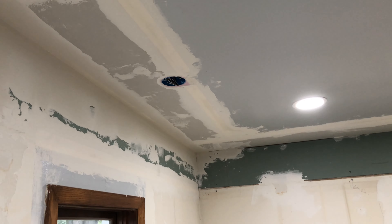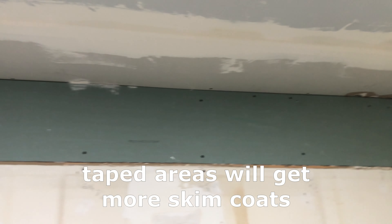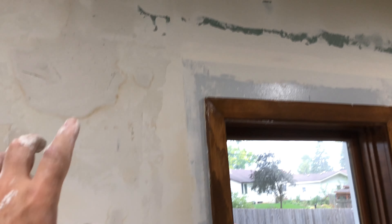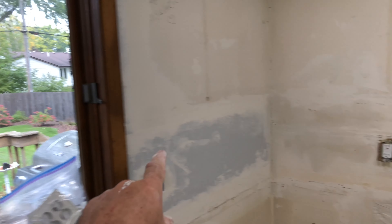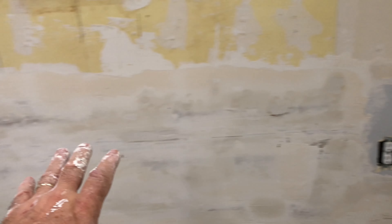Got the tape at the ceiling where it meets the wall taken care of. This one here is going to need another coat. I'll skim coat all the areas that are going to show — that backsplash I put a little there today, but next time I'll really skim it and try to get a real level surface. Thanks for watching — we're going to be uploading another kitchen renovation video soon, so be sure to subscribe if you haven't yet.